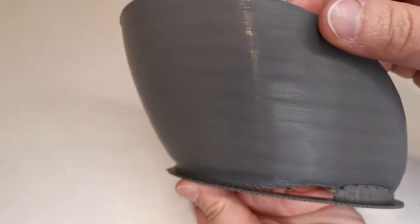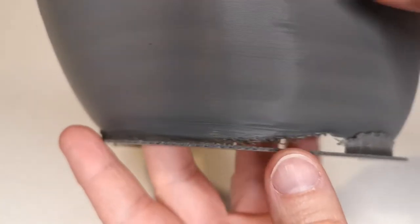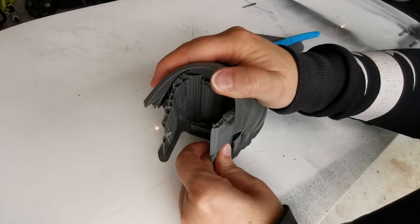However, there were a couple of things I did notice with the faster profile. This piece printed with the faster profile did have some of the supports fail. It didn't affect the print finishing at all, but you do start to run that risk. Chep uses a zigzag pattern of 20% infill, whereas I used a line pattern of 5%, as I've been having some trouble with supports coming off the models. So if you're going to use this profile, you may need to slow down the support speed or go back to what Chep's using — zigzag with a higher infill.